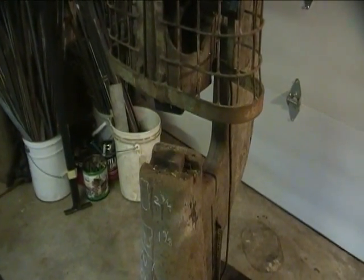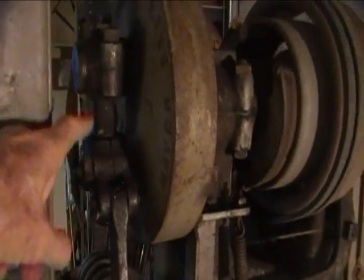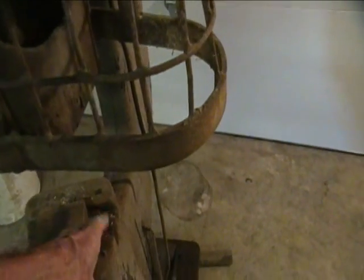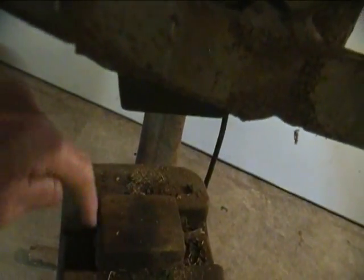Dies — I forgot what the price is. A simple drawing die for this machine, I don't know — I was going to say 150 bucks but I don't even want to guess. But there's the hammer: it goes around, it runs, it would hammer. One might get rid of the t-duh sound just by adjusting the throw here, but I seriously wouldn't want to do anything serious with it until I cleaned up this die cavity. What you do is get that nice and flat again, then put a plate in there that makes up for the difference — like if you went down a quarter inch, you'd put a quarter-inch plate in there. That brings it back up to the base height for a new die. A new lower die would be three inches tall, so this one has lost an inch and an eighth of net height, not counting the quarter inch it's further beat down in there.